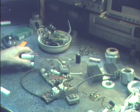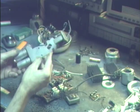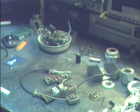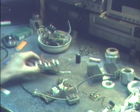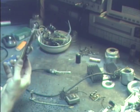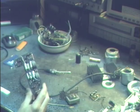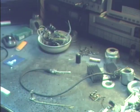First I'll show you what comes out. This is basically your filter capacitors. One of the output transformers gets chucked. This is the set of driver transformers for the unit that gets chucked. This is the existing tape head preamp board that goes. This is the existing power amplifier board on units so equipped with their own power amps. Since the 8-track after conversion will just be sending a line level signal to the converted radio, we no longer need this, so this goes. This is another one of the output transformers that goes.